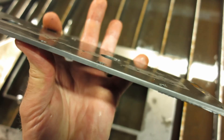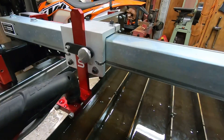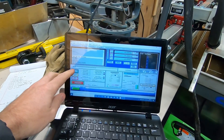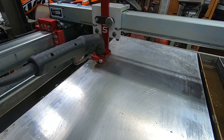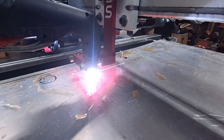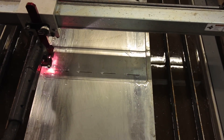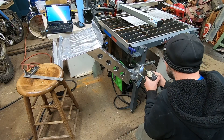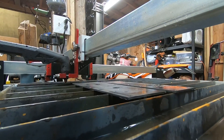One of the biggest things I'm really excited about is precision — you can go to the computer, draw up a part exactly how you want it, get the holes cut out exactly where you want them, do hole patterns, do slots. We've all done slots manually by drilling two holes and cutting between them with an angle grinder, or milling on a milling machine — this thing you just draw it up and cut it. The really cool thing is if you get a part you want, you scoot it over, re-zero it, hit cut, and you've got duplicates. You can cut parts so they key together for welding. I'm learning how to rethink fabrication by designing with this thing — the sky's the limit, you can think it up and you can probably cut it. It's a pretty rad tool.